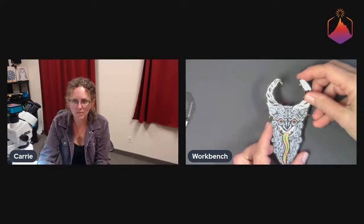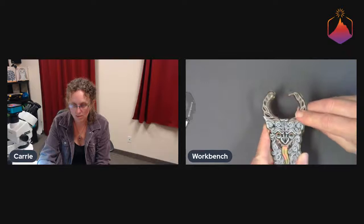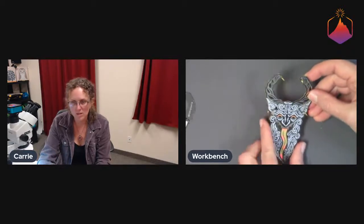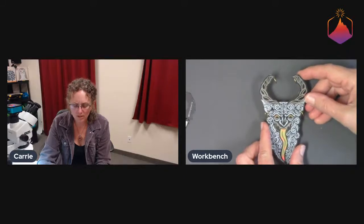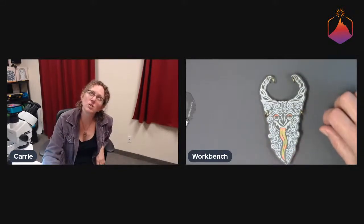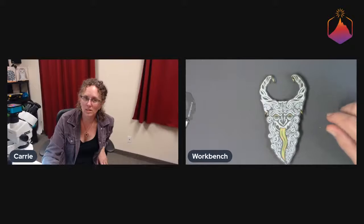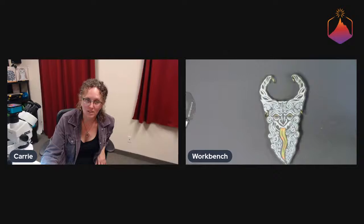Let's put it this way: we have the flashy blinking like that. And then we have the pulsing mode like that. So these guys aren't full on all the time even. I think the current draw should be about 25 milliamps if they were fully on for all the LEDs in total. So we're looking at about 10 hours of battery life if it was pulling maximum current all the time. I think it will be at least twice that, just based upon the on and off and the flashing cycles. They're about a 50% duty cycle. So I think that a single battery should last about 20 hours.